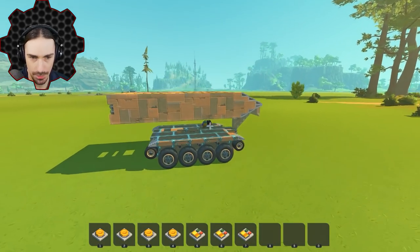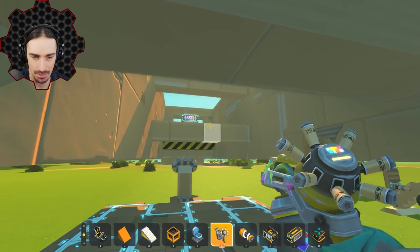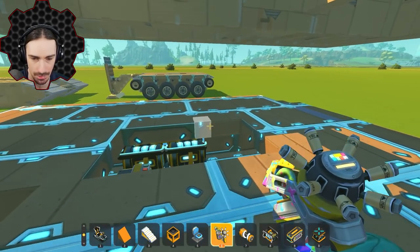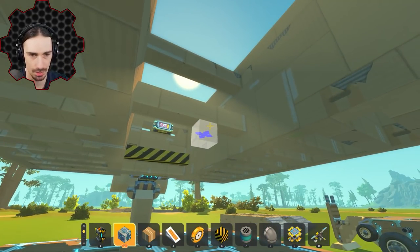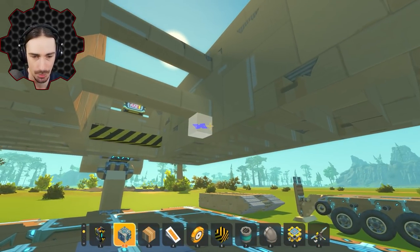So now, the other thing that I need to do is get this bridge to settle in place and not slide off once it is retracted and pulled back up onto the tank here. I don't think that should be hard to do. My plan is to use this crossbeam right here and have it settle into a groove that'll lock it in position when it's down here, and it can be easily lifted out and put back in.